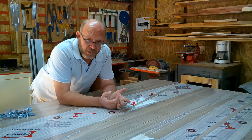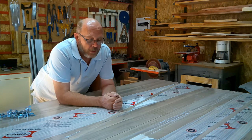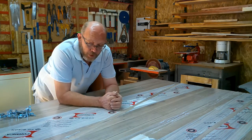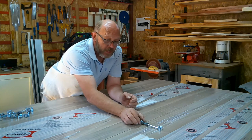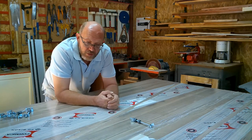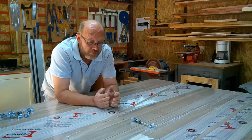I hate working with formica — it's press wood, and press wood is not very strong. I thought it was going to be a quick and easy job, but there are some surprises. My plan is to biscuit it all the way, every 150mm apart — biscuit and glue — and then use the little formica top brackets, routed into the bottom for the braces, and then pull them together. It's not going to be structurally very strong, but it just needs to join them so they can put it on the island in the kitchen.